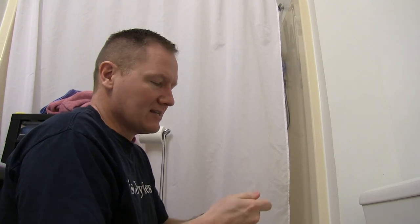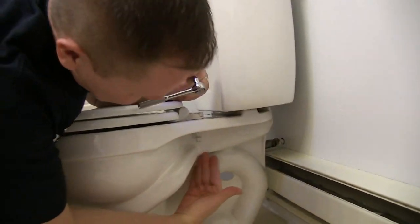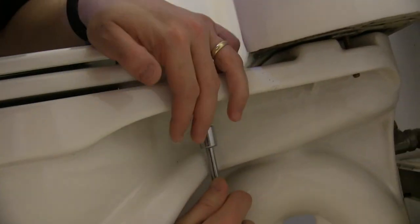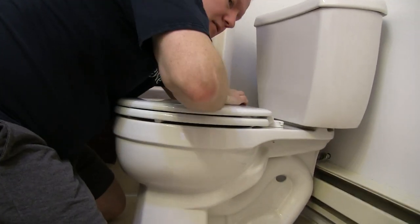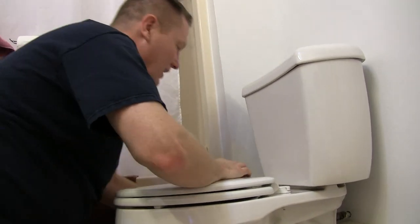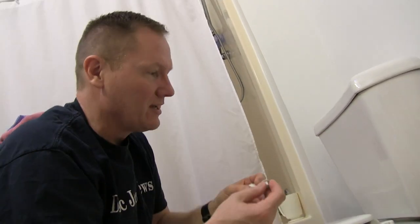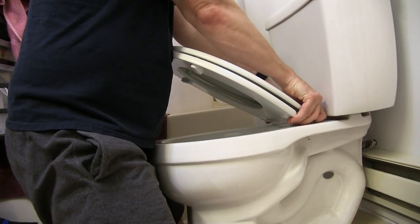I got the extension. What that will allow me to do is get down below — you can see there are a lot of different contours here, so the extension lets me get below that and get the full nut inside the socket. And there — that's how close it was to snapping that one off. So we'll do the same on the other side. That ability to break it off under the torque of the ratchet allows it to be tightened and set itself into the porcelain, so it won't pop off and have problems later.